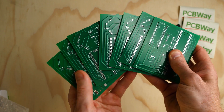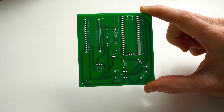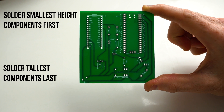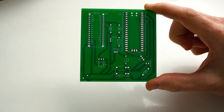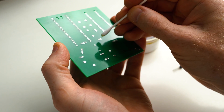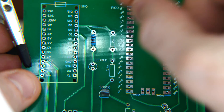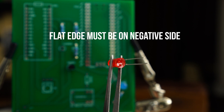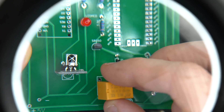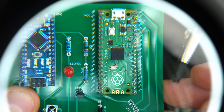Next up is connecting the components to the PCB and soldering them into place. A general rule when soldering PCB components is to start with the smallest height components first and finish with the tallest ones to make the job easier to navigate. Before soldering the really small components I apply a small amount of flux to encourage the solder to flow once heated. The order I soldered the components was: the transistor, then the resistors, the LEDs, the infrared receiver board, relay, Arduino Nano, and lastly the Raspberry Pi Pico.